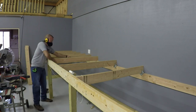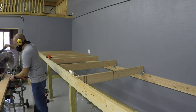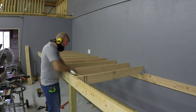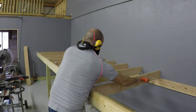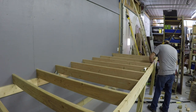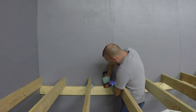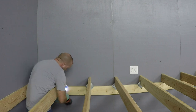While installing the joists, I drive in the top screw and then use my square to make sure the joist is vertical. I decided to use rafter ties to hold a joist vertical — joist hangers weren't going to work and I didn't want to use single-sided tie strips. You'll see how everything ties together shortly. Also, hit the pause button and let me know in the comments what you feel has been the best storage solution you've implemented in your shop — I'm always looking for ideas to make my storage more useful and efficient.